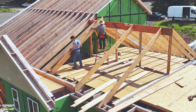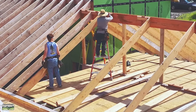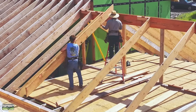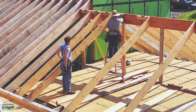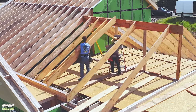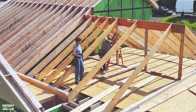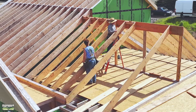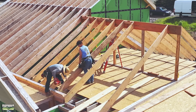Some people hop back and forth maybe two rafters at a time. We've been doing this a long time and I find that once the ridge is straight, we can go ahead and stack one whole side. In this case it was only about 20 to 22 feet long, 2-foot on-center rafters. If we're not perfectly straight on the ridge we still have some adjustment because we haven't nailed anything at the glue-lam on the bottom left, and we haven't nailed anything at the plates except for the ones that are tacked. Keep it at bare minimum until you're sure things will stay straight.